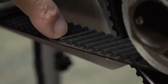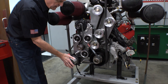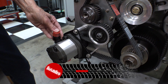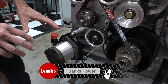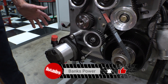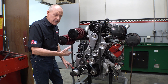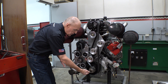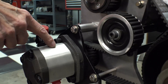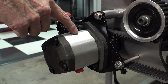The first thing we're driving off this system is the power steering pump. This is a commercial hydraulic pump, very similar to what's being used by all the teams in Monster Truck. Those guys commonly drive them at about crankshaft speed off the nose of the crank on the Chevy 540 inchers, and they also commonly fail the pumps — so we thought we'd drive it a little slower.